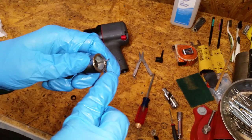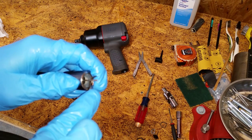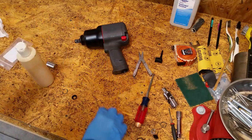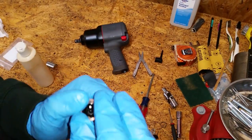Compress the spring with the new seat. Use something rounded to avoid damaging the new seat as you evenly push it down past the snap ring groove. Drop the new seat support down on top and reinsert the new snap ring, making sure it's fully seated in the groove.